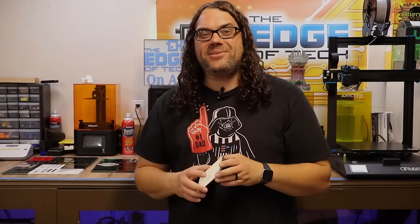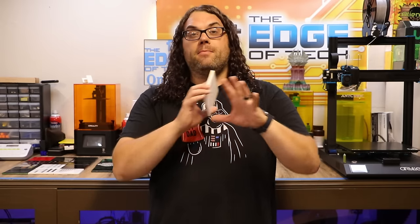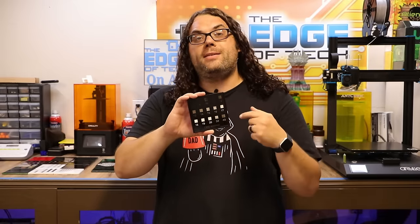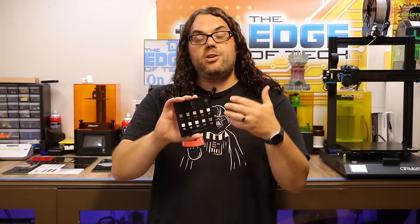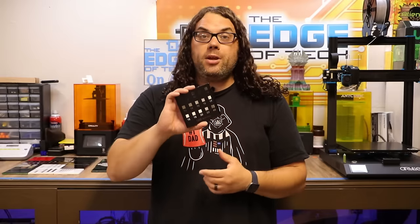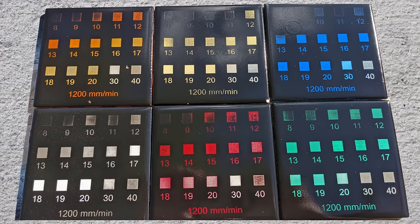We're talking lasers today. We're going to be using cheap white ceramic tile that you can get at any hardware store. This stuff is super cheap and it makes some awesome projects. I'm going to teach you how to create a pattern on that tile — it's all based on your burn percentage. We'll take the percentage we like the most, burn a tile, and hopefully get the colors we want. You can do this for every color you have, giving you a whole bunch of tiles so you can tell exactly what color to choose when you burn on your laser. It's kind of like a benchy.